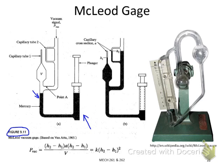So usually this fluid is mercury. And on the left hand side, the tube has an inlet, and this inlet will be connected to the vacuum source which we want to measure. And also it has a fixed volume chamber, and this tube is connected to the chamber. And at the end of the chamber, we have a capillary here, and besides it, it also has another capillary. So those two capillaries are the locations we read the pressure.